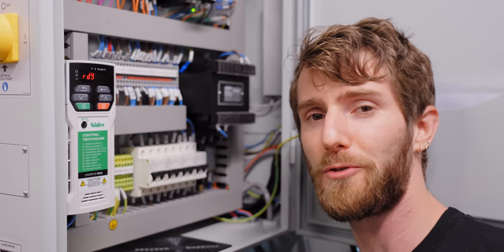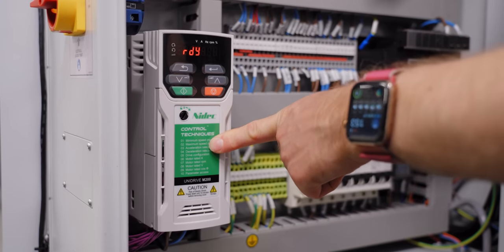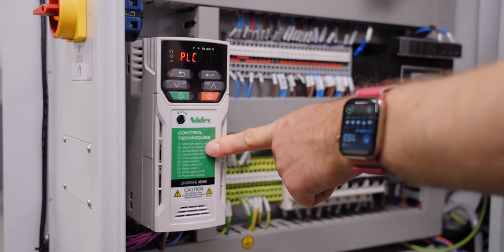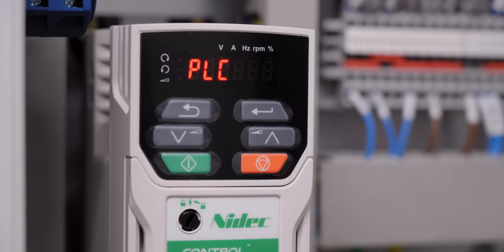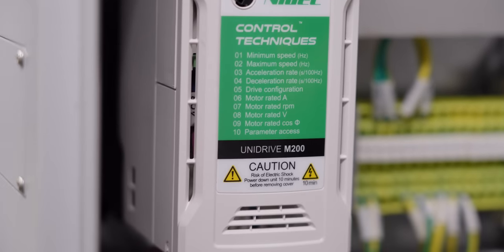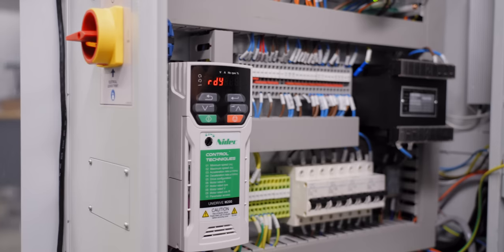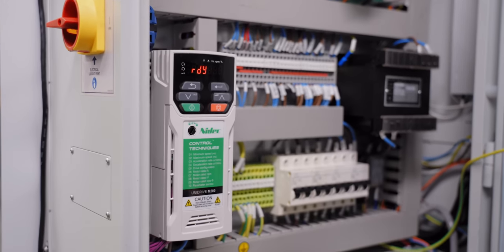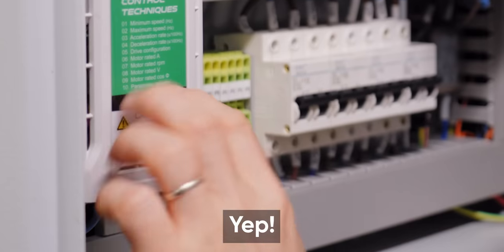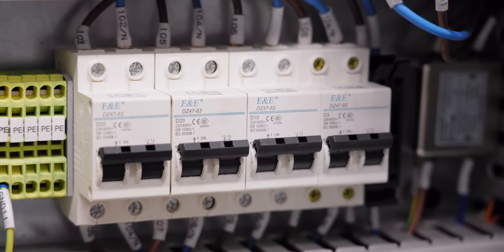On the topic of spindle control, of course we want to do more than just stop it, and this puppy right here is our spindle VFD, or variable frequency drive. You could think of this kind of like the PWM fan header on your motherboard that can make it run at different speeds depending on how often it pulses power, except on absolute steroids. So we can drive the main spindle at up to 10,000 RPM, and all the way down to what, 100? Something like that? Fancy. The rest of this is cable management, a variety of breakers and relays.